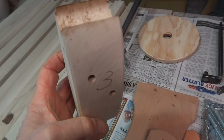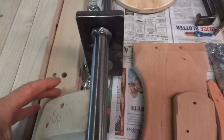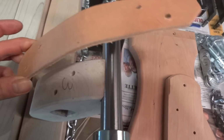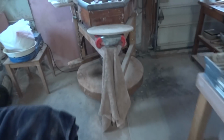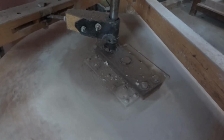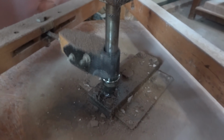So that's that. And this is what we call the coupler, which basically goes on there like that, and is held in place there, and then it has the leather strap, which straps this through those holes there, and then it comes all the way around, and that's what holds the crank to the crankshaft. What I'm trying to talk about is this piece here with the leather. Now there is a collar underneath there, so the height is governed there on the collar, as this is on the crankshaft here.